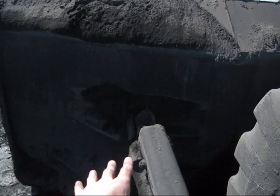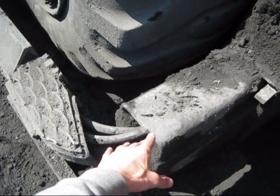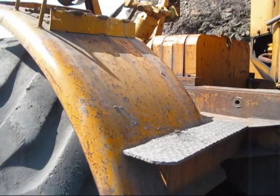On each side of the dozer arms is a single cylinder which connects to the dozer blade, and these cylinders are to push the dozer blade forward and back. The dozer arm connects to the superstructure of this machine at this hinge point right here. This beam mounted to the superstructure is what receives all the stress when this dozer goes to push into a pile of material. Right here you can see where the two hoses run from inside these shields out to power the cylinders in the front.